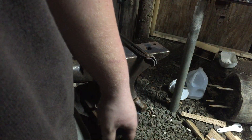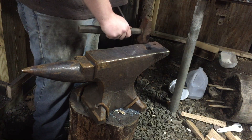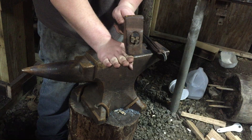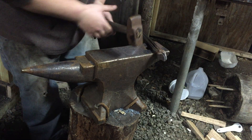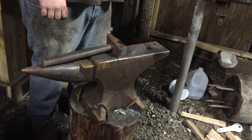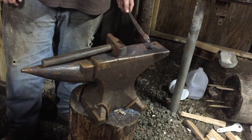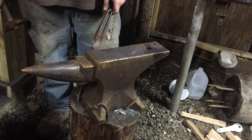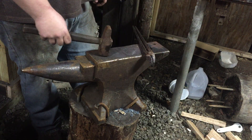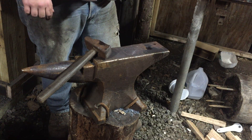I really hope you guys can hear this. I'm going to explain this real quick before we do it. We're going to do half-on half-off blows. Pretty much if this is your anvil face — you want half of the hammer face on the anvil and half off, and just hit it right there to get the little sit-down put in. Much easier than pretty much any other method. I go back towards the tail or the heel of my anvil because it's got a sharper radius, and I like it because it's got a smaller section compared to my bigger anvil.